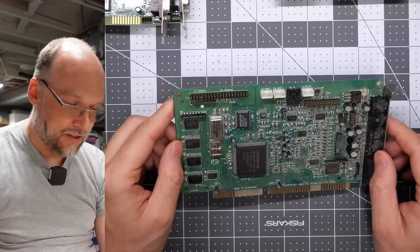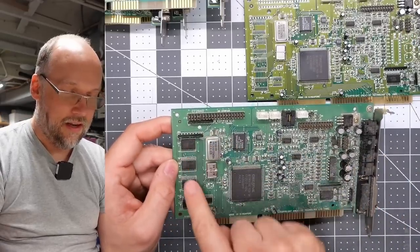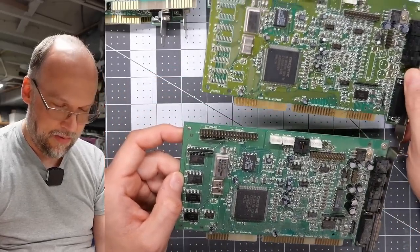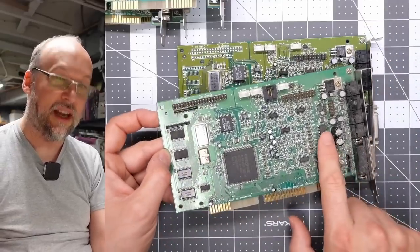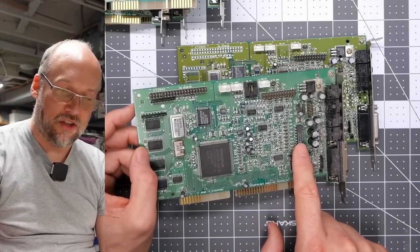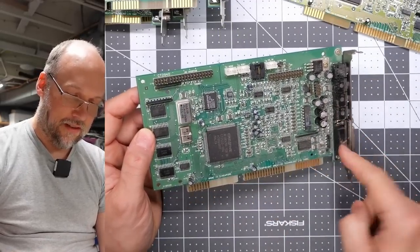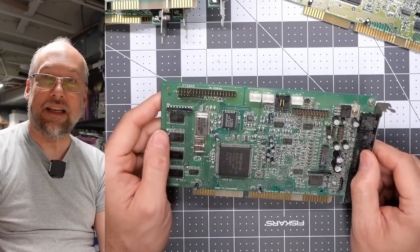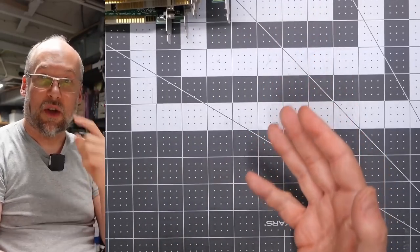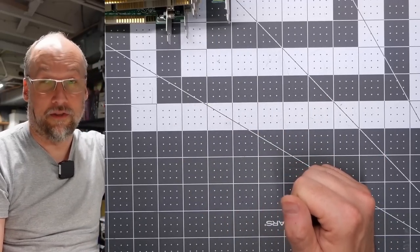Going into the box, there's another CT2940 — same part number as the last one, but this one has the expansion connector installed for CD-ROM with bus transceivers populated, which weren't on the other. It also has additional components populated — an amplification IC with a speaker-out jack — which were missing on the other card. This one is a lot more dusty, so I'll set aside cards that need cleaning for a good wash. The sound cards should all be testable on my bench, which has Sound Blaster software installed.